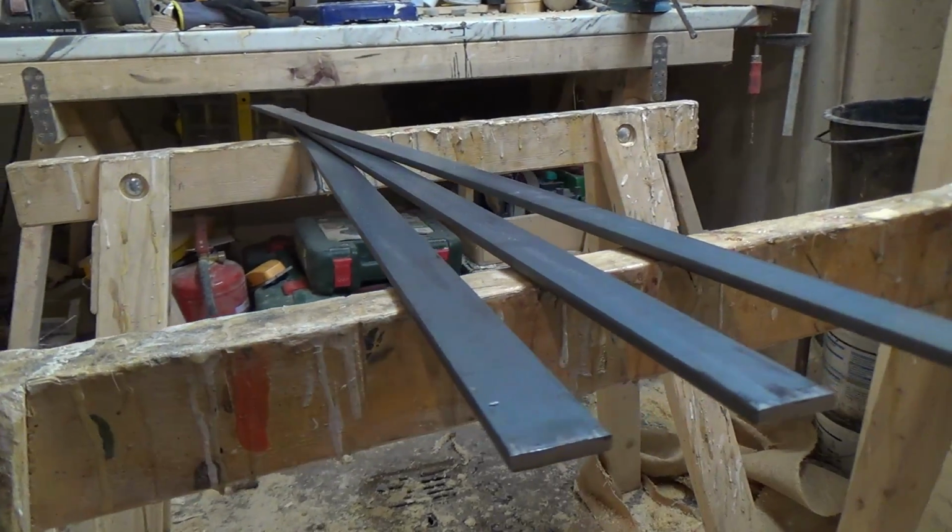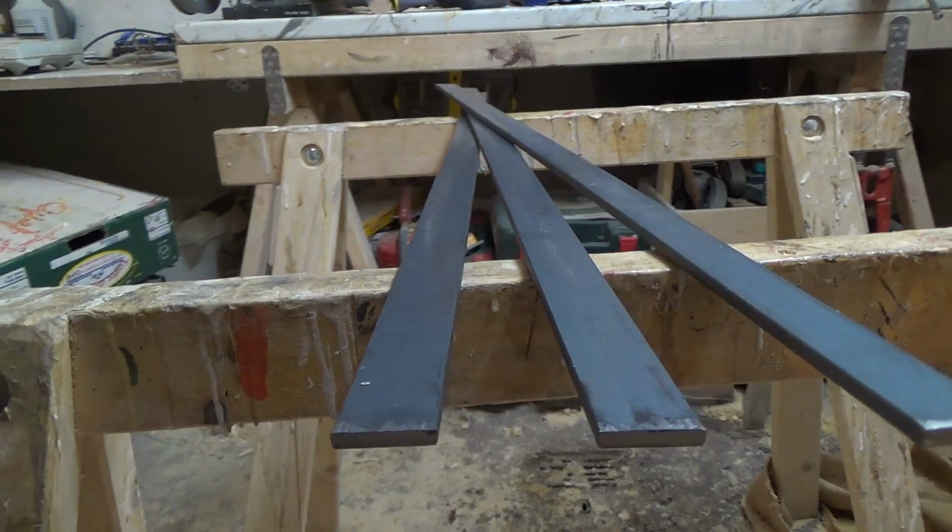But because this kite shield is so big, I have to create some special tools because it won't work in the way I usually handle that. For the tension we'll use a tension strap, but if we don't have a shape we can bend the shield into, the force wouldn't get distributed evenly, and that's what we're gonna do now. For that I bought those 3 pieces of metal.